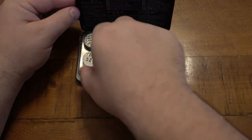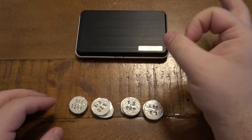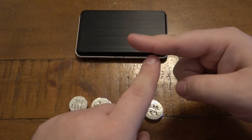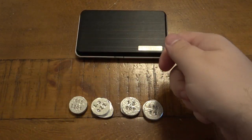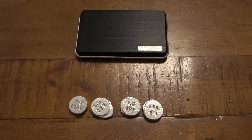I had a lot of fun doing this. It's not all that much work since I'm doing a smaller amount - if you're doing five or ten ounce pours it's going to take a little longer to heat up and melt. I learned a lot. It's very difficult to have a steady hand - when you have a glob of molten silver and go to pour, there's a tipping point where it's literally not moving, not moving, and then it wants to move all at once as a full mass. It's extremely difficult to stop mid-pour because it comes out so fast in one glob. What you want to do is pre-measure your silver and put exactly what you want in the furnace so when you pour it weighs exactly what it's supposed to.